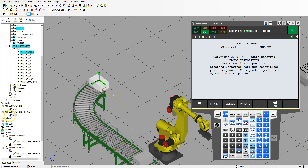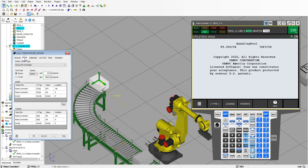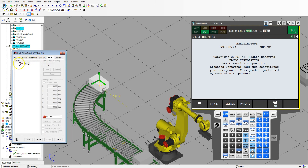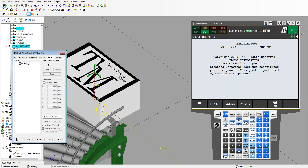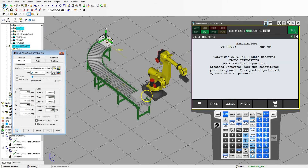So we go into the round belt first, let's go into that link, double click it, and right where it says parts — in Motion just go to parts and check box one, hit apply. You'll see your box one show up and you may see kind of a haze because there's a box within a box. So if you don't want to see that haze, go to the link CAD and where it says visible, go transparent — and you'll get rid of that haze. Then hit apply and move on to the next one.